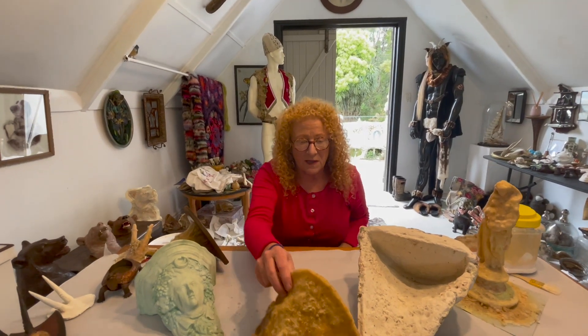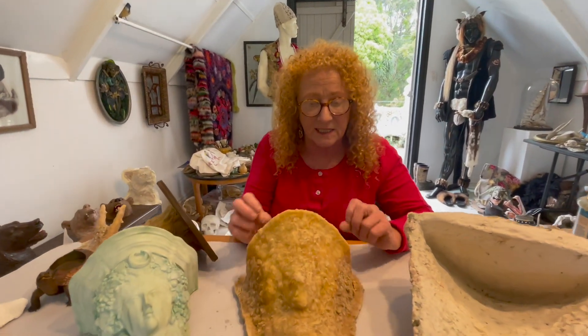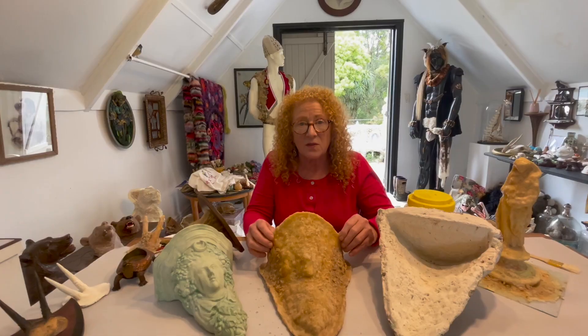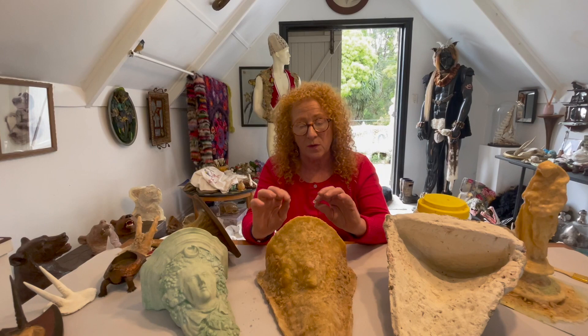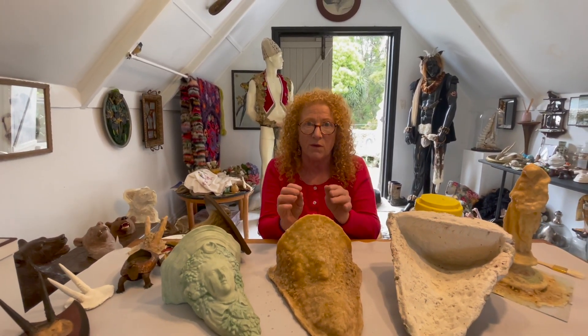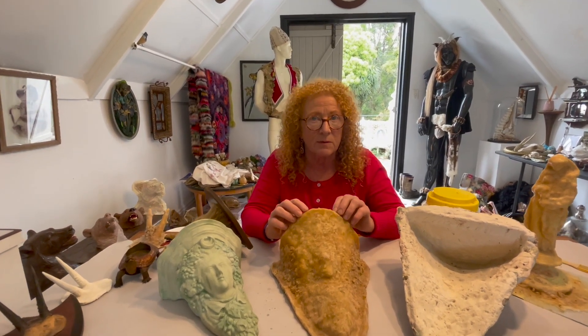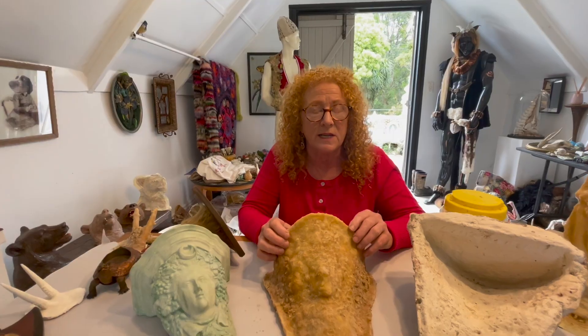One of the most important things to remember with latex is to keep it out of the light. All of mine are in a dark shed and then put into plastic tubs. There is a possibility that they can go gooey — meaning they'll go soft and liquefy if they touch metal — and light will make them shred and possibly delaminate so that the layers will become undone.